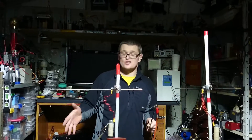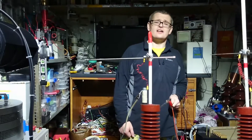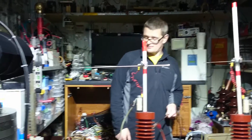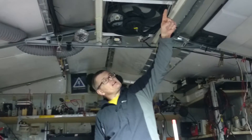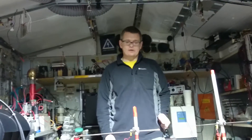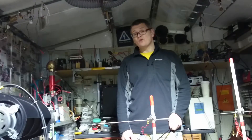That is one sweet X-ray transformer. That being 240 volts into it, and only because it's through the half-bridge IGBT I'm getting half of that. When I've got a full bridge, the arcs will literally be from here all the way up to about here — and that is no messing about. You're looking at four feet of arcs easily off a 150kV transformer at that power. That's a thousand milliamps at 150kV — that is some voltage and current. You don't want to be touching it.